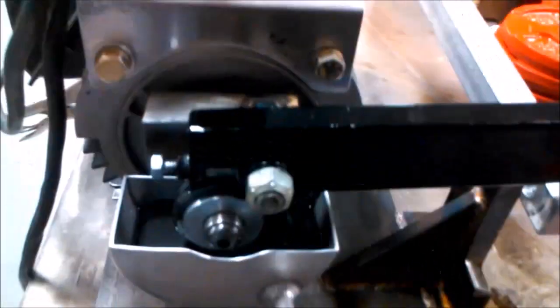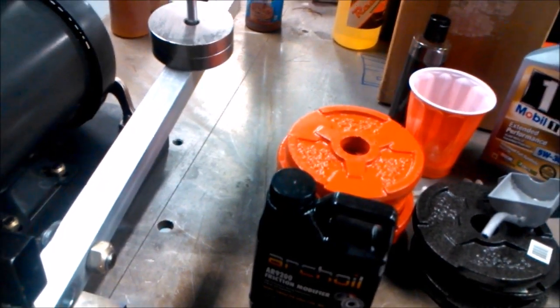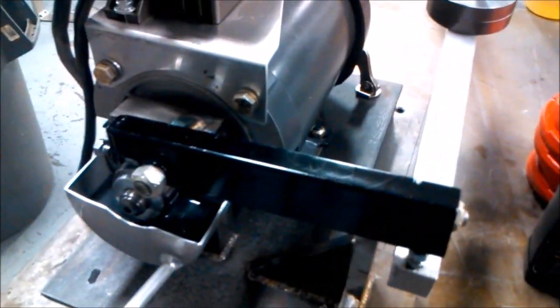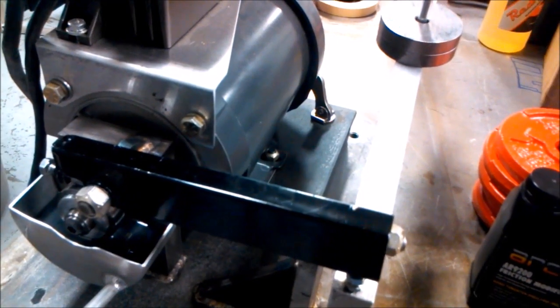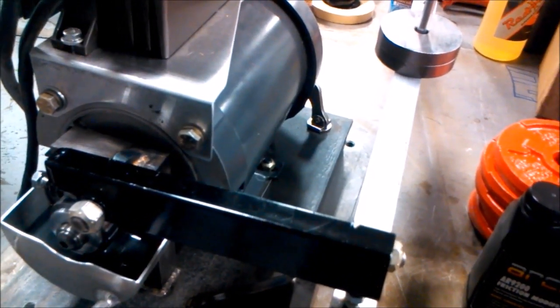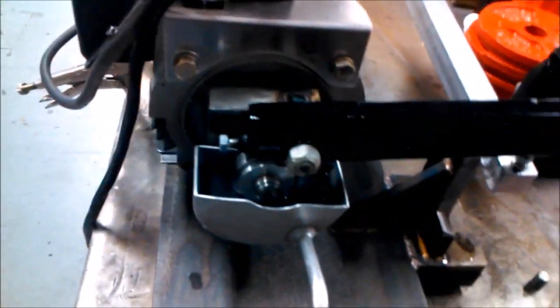The ratio on this is 54.33 to 1, and we're going to apply some one-pound weights to start with. That's not very good. We put on two weights. The Mobil Exxon 5W-30 normally tests with no additive at 162 pounds of load. We had two weights times two pounds — that's all — equating to 108 pounds of load.